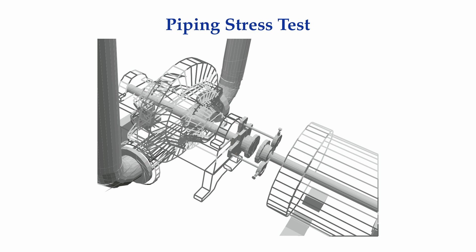Static piping stress is defined as the amount of stress induced into the machinery when it's not running. Dynamic piping stress is defined as the amount of stress induced in the machinery when it is running. Bear in mind that some of our machinery is flowing hot process fluids. Metal expands when it gets hot and may therefore move enough to induce loads when the equipment is operating. Dynamic piping forces are extremely difficult to measure — I don't know anyone who's ever tried to measure it. If piping expansion does occur when running, the machinery might have a chance of not moving, assuming we had no static piping stresses to begin with.